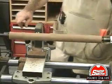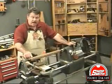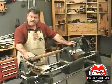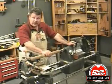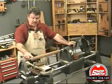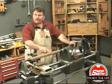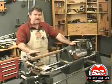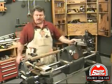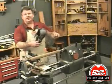You're probably saying, what about this end right here? I haven't quite done this end. Well, all you have to do is take the work out of the lathe and flip it end for end, and then you can get the part you didn't reach. That way, you can make a perfect cylinder to a precise diameter with very little effort — just a little measuring and a little patience is all it takes.